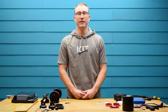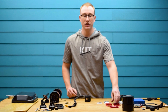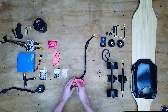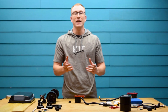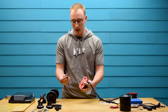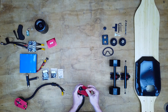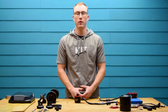Now it's time to assemble the drivetrain. Place the motor with the O sticker onto the motor mount with a dot on each side. Position the wire as shown and secure the motor using four M4 bolts located in the motor hardware bag. Then repeat this process to secure the other motor to the motor mount. Next we're going to install the motor pulleys. Take the motor pulley and align the top of the motor pulley to the flat spot on the motor shaft, then press it on. Take your allen key and tighten up the motor pulley, then repeat this process for the other motor.